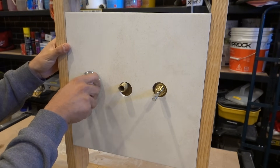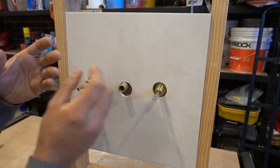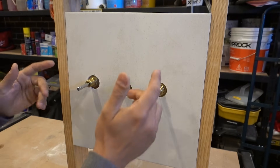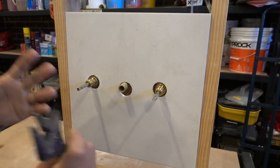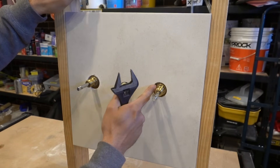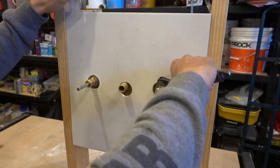Now we've got access to our spindles. These spindles have a washer on the end and that's what actually opens and closes — shuts off and opens — to allow the water to come through. To remove these, once again use an adjustable wrench. If you've got plenty of access you can open up your wrench, find the little groove on the spindle, bite onto that and back it off.